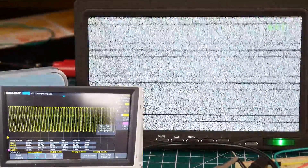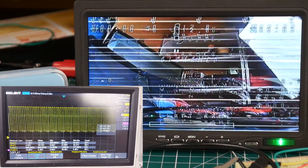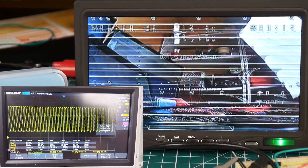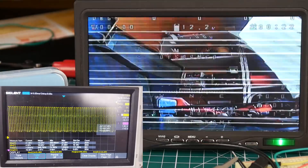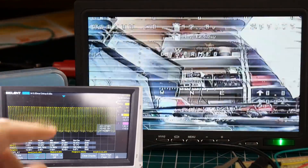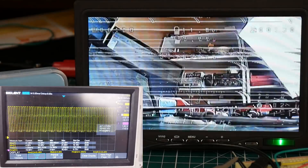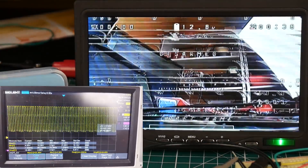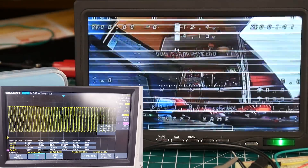We've already started and this is just absolutely terrible noise. I don't know if anyone's ever gotten it this bad, but if you have, please let me know your setup because this would be horrible. On the oscilloscope we have around 16 volts of amplitude — this is basically turning into AC current. Usually noise jumps up and down around 7 volts or so, but right now we're jumping up and down around 16 volts, which is pretty insane.